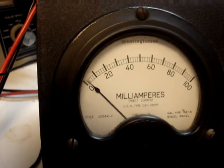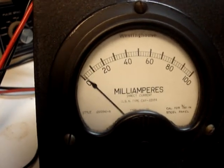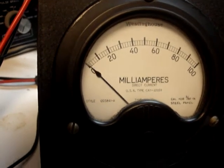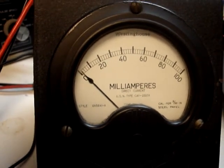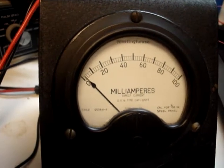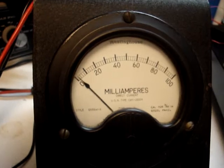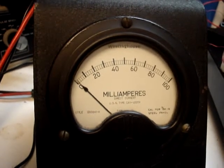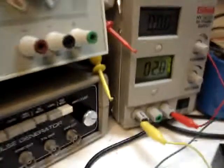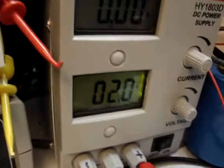This here is the current right now that I'm running. I'm running on 2 volts, and also in series with a 100 ohm resistor. So the total circuit is 57 ohms of the coils and 100 ohms in series — total series resistance is 157 ohms — running on 2 volts.